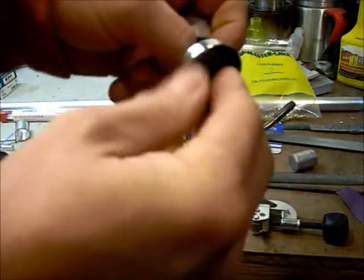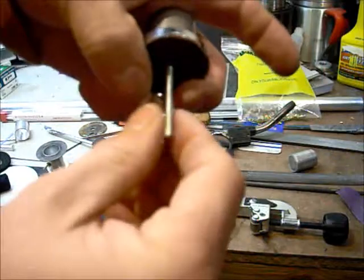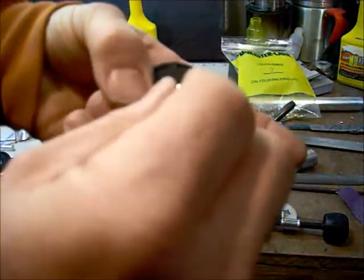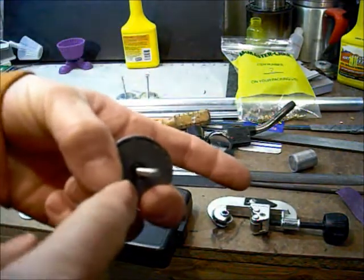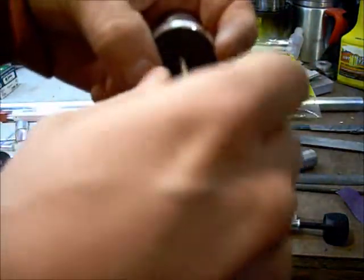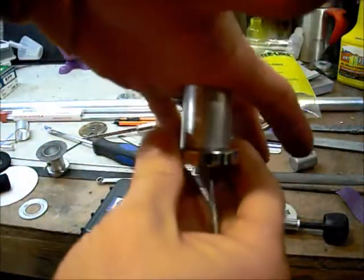I place the magnet on here, run it all the way up like that. Then I put the nut on, run it all the way down into the hole. Once I get it in the hole, sometimes I'll have to take the point of a really small screwdriver and stick it on the side of the nut just to get it tight. I'll spin the magnet with that in there and it will cause it to tighten down, lock tight.